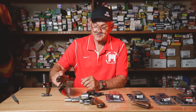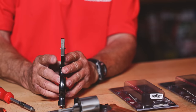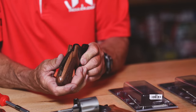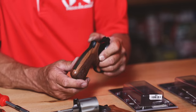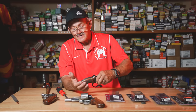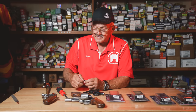The square butt is even easier. We're going to do the same procedure — look at the pin to make sure it's square and also the same length on both sides. Take the stock, put it in the channel, bring it into its relationship to the frame up to the top position. You know it's fully seated when the wood contacts the top of the frame. This one fits and comes in and out really quickly; it's easily removable, so you know it's a proper fit with the pin.